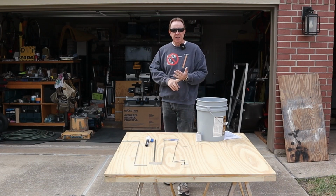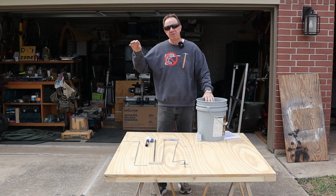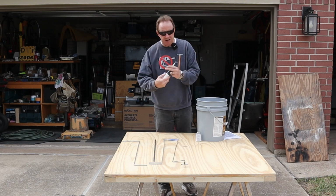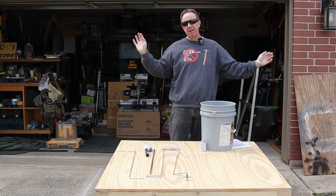because I've got new heating elements on order and I've got a new anode rod on order. And so I'll have to drain that in order to put those in. And at that time, I'll replace that valve in there with a brass fitting that's got a hole all the way through it. So maybe once a month, I can just open that up, flush some sediment out and be gone.